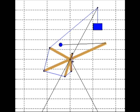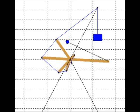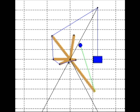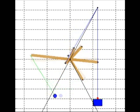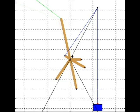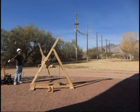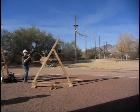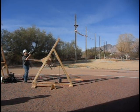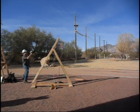So now I'm back to the drawing board, just as I get the new simulation running and I see a possibility. Moving sprocket 1 to the back side of the throwing arm forces the rope to stretch earlier, allowing spring energy to rebound before projectile release. This is exactly the kind of tuning I was hoping to find. I design a new throwing arm and head to the test range. It takes three people to load, but we get the full 90 pounds up and fired. Take a look in slow motion — the counterweight comes pretty much to a dead stop at the bottom. Beautiful, yes?